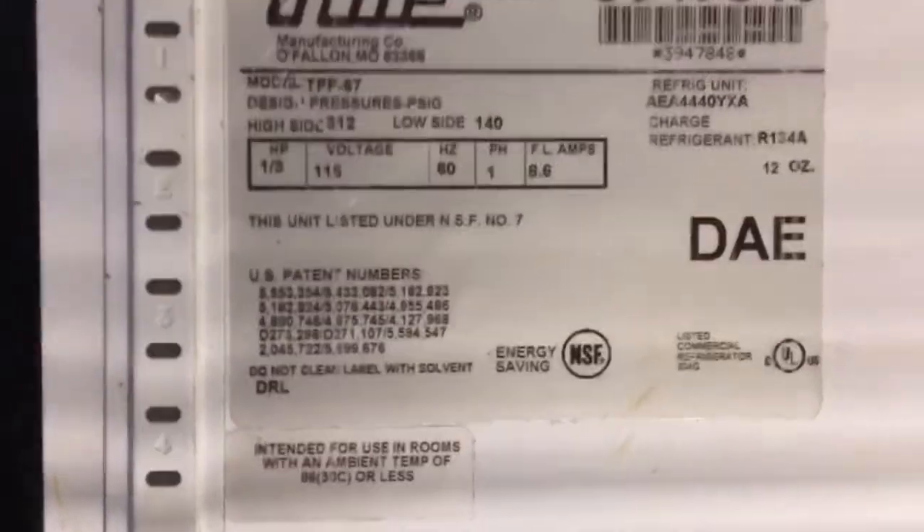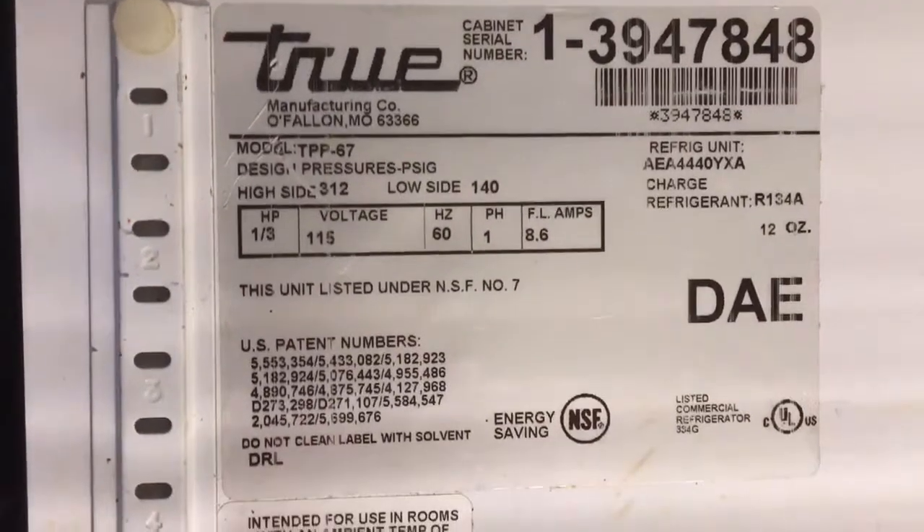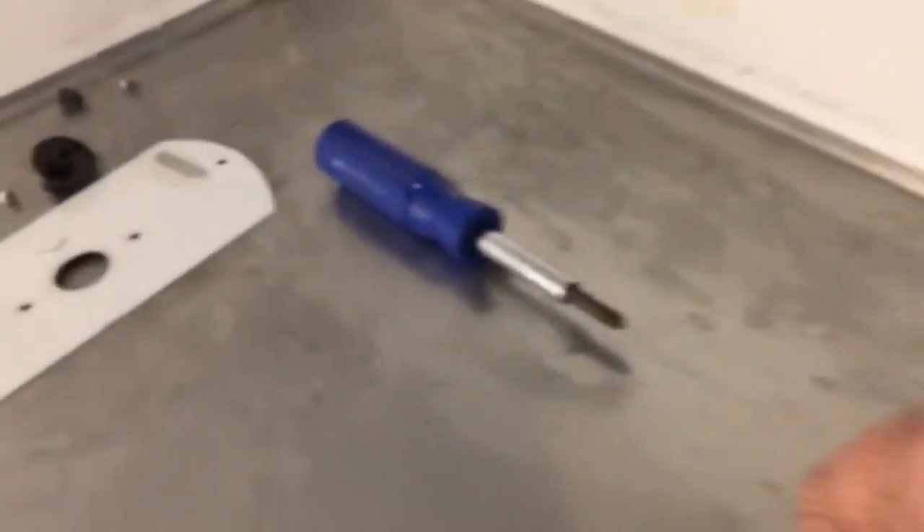So can't use them on a cook line. The customer complaint was temperature — the temperature in the box has to get really high before the unit comes on. I checked that and yeah, the unit wasn't even coming on and it was already 50 degrees in the box. That pretty much means your temperature control is toast. Here's the old temperature control I pulled out of it.